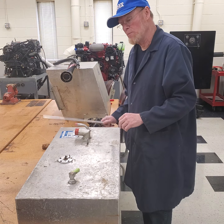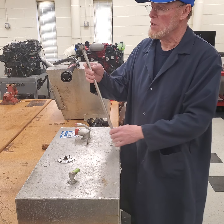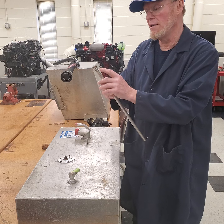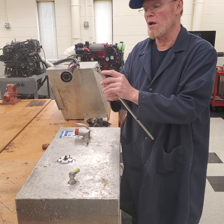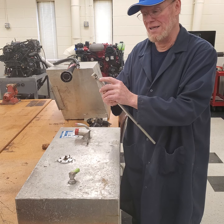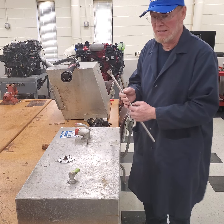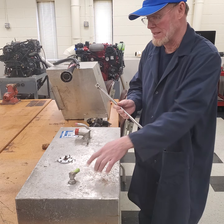I have one here that comes out of this tank. This fitting will accept a quarter inch pipe thread. This is also a three eighths pipe which will thread into the adapter that may be welded into the top of the tank, much like this one is welded into the top of the tank.